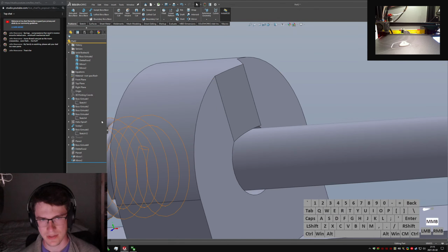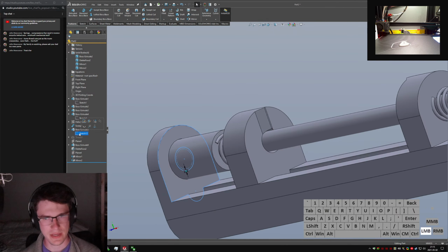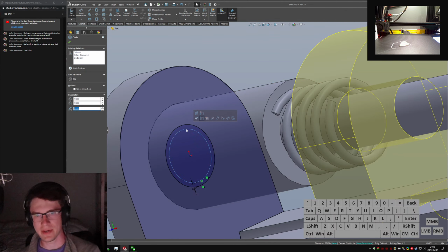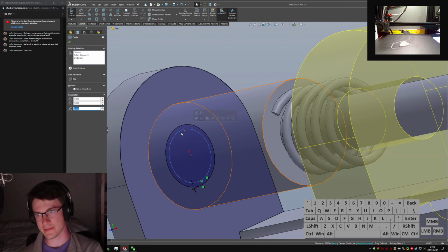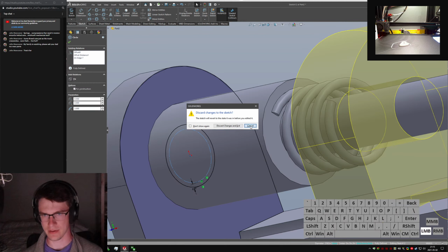Huh. Maybe the move face... Oh, you know what it was? So when I made that change, back in this... That original interior surface was created by this line, and SOLIDWORKS' internal identity of that was the same, so I could have changed that dimension, it would have been fine, but because I added the offset, the face that it extruded to no longer exists, and so that's why you get that particular error.